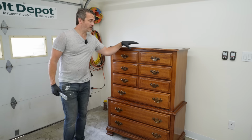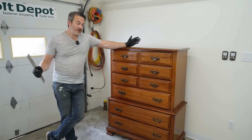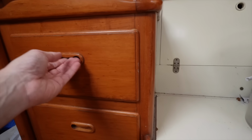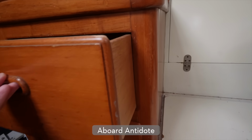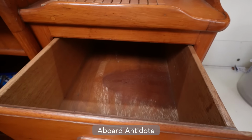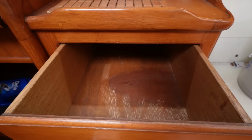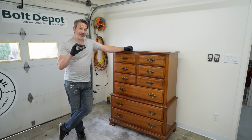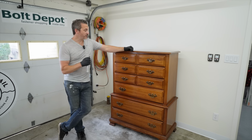Now, this would actually apply to the boat and maybe to your situation if you're working on your boat, because a lot of these old cabinets have these slide mechanisms that don't come out all the way. They rely on a tight fit and they come out maybe 3/4, 2/3 of the way out. And then you have to leave them, otherwise the drawers will fall to the ground. So the slide like this allows you to do a full extension and use all of the space.